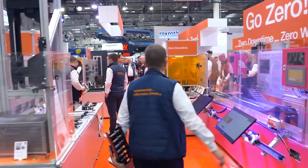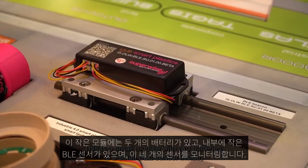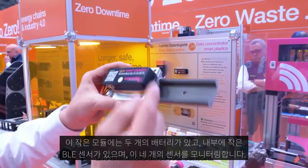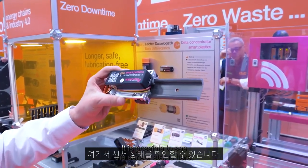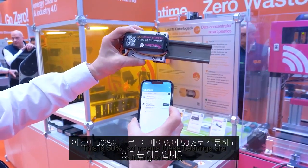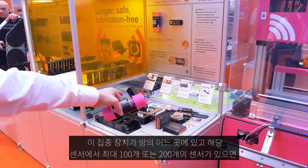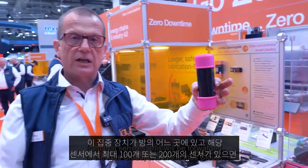Please follow me. Another news this year is the BLE module. This is a small module with 2 batteries, a small BLE sensor inside, and it monitors these four sensors, and it is possible to see the sensor status here. This is 50%, which means these bearings are running at 50%. If this concentrator is anywhere in the room, and there are up to 100 or 200 of these sensors, this will be forwarded to the igus cloud, and in the igus cloud we are able to create orders directly.